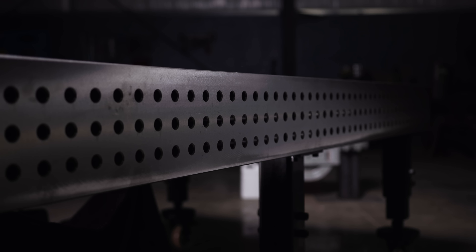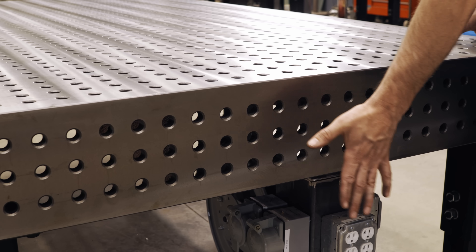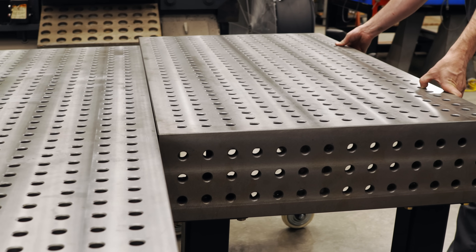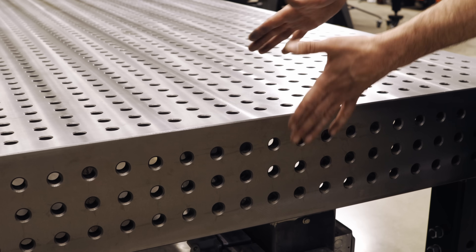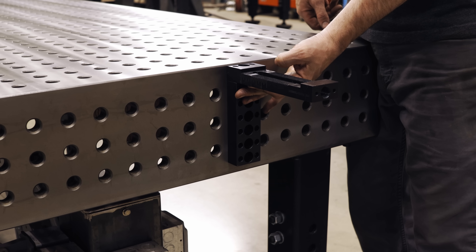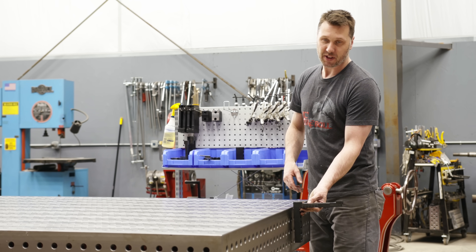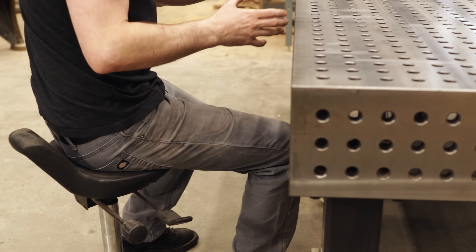Because this table is a giant piece of cast iron, this allowed me to have a 4-sided table. That's a great feature because it adds to the rigidity of the table and gives me a 90-degree corner for fixturing. It also allows me to butt two tables together, use the full length of the table to put fixtures on the edge as a stop, or extend the table surface out by bolting accessories to the side. So I can go up or out, which is extremely handy when you need just a little bit wider table — but it still allows me to sit at the table and get my knees underneath.